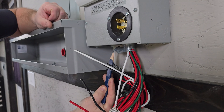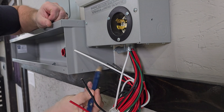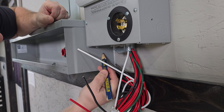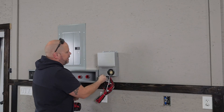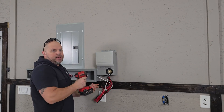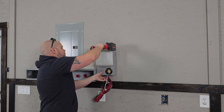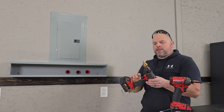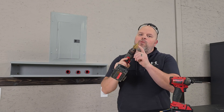We need to find the center of our conduit and mark it on the box so we can start drilling our hole. Now that we've found our placement, I'll take this off the wall and get the step bit to drill into the electrical trough. This step bit has all these different sizes — once I drill through, we're going to take it right to one inch.